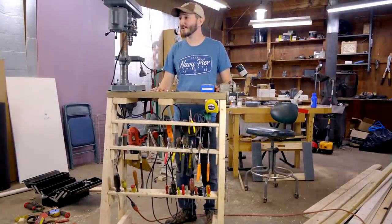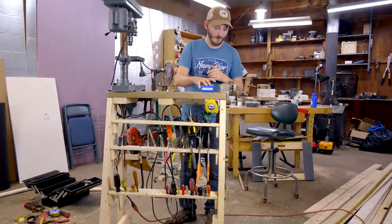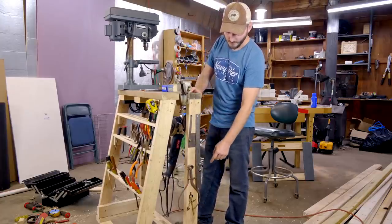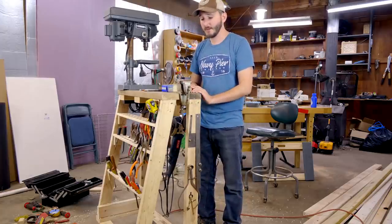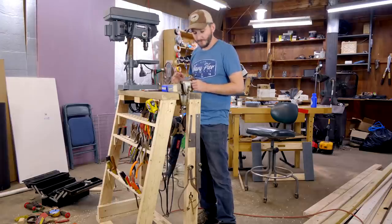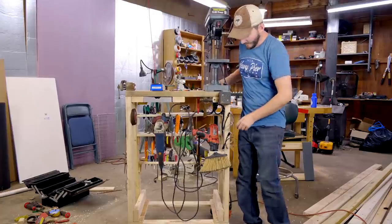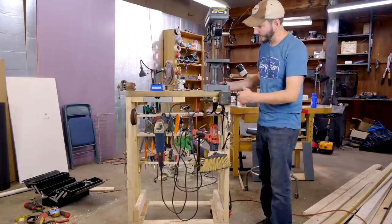Day two. I went to bed last night after a few hours of working on this and made a lot of progress I didn't have time to film. I have all of my measuring tools on this side — rulers, a compass, calipers, and similar things. I figured that'd be convenient to have under my vise, which is a clamp-on vise so I can move it to anywhere on the bench. On the back side, I have my safety glasses hanging on some fencing staples so they are readily accessible when I'm using the drill press or any of my power tools.